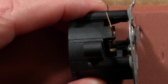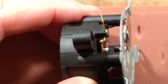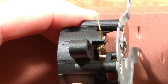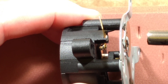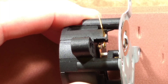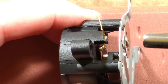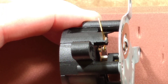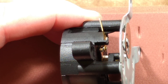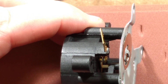Let's adjust the exposure and focus down onto those contacts. I'm going to heat that disc and we'll see — did you see that ceramic pin just push the contacts apart? Interesting — when it closes again though, you can actually hear the contacts touch just before the thing actually clicks back. There's a slight moment that it just touches. You can actually hear it more obviously without the fan running.